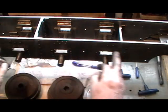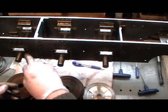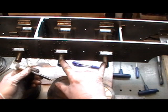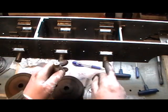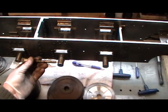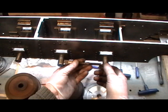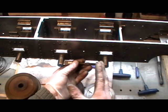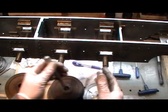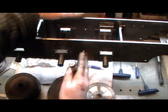If you've done all the rest of your machining as shown in my previous videos — the frames, horn guides and axle boxes — you shouldn't be too far out. Front to back isn't as important as side to side. As long as the opposing sides are equal, it doesn't matter if they're a little narrower or wider in length, because you just make your connecting rods to suit, as long as they're the same on both opposing sides.